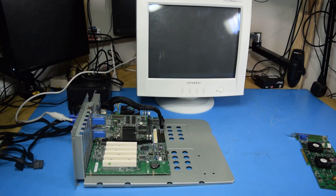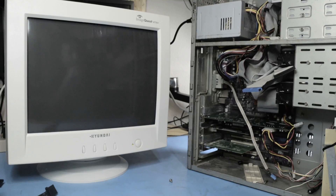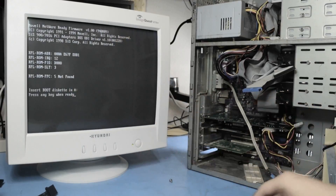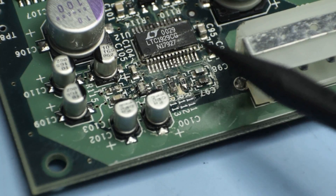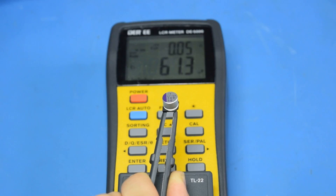Well, it works with something that's not a Voodoo 5. After putting it in the old 98 machine, I found the card did work, but when I was trying to move some cables inside, I bumped one of the capacitors and found it was extremely hot. This told me something was wrong immediately, and I pulled the card out and set it aside. Now that it was apparent there was a hardware failure, I knew I needed to start looking at the capacitors. So I started pulling off capacitors near the power connector where it was getting hot. That 100 microfarad super low ESR cap is way out of spec.